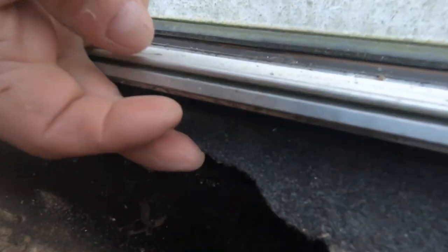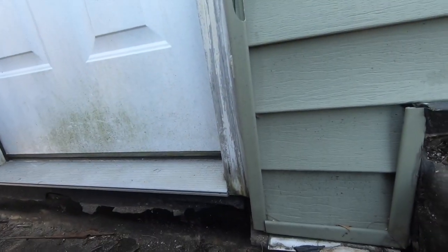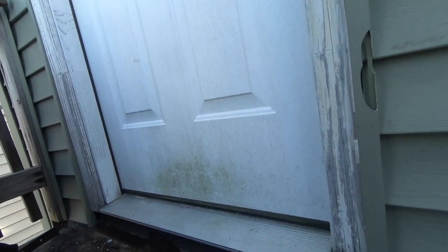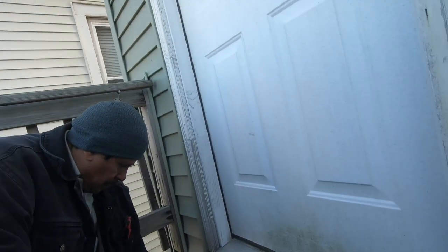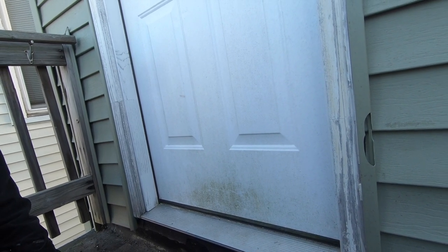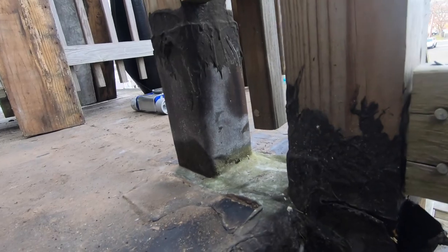You can tell there's no copper pan underneath this door. I'm not fixing that — they need to take the door out. The door has to come out and a new pan, copper pan or any pan, has to be installed. That's bad. This is what's leaking.